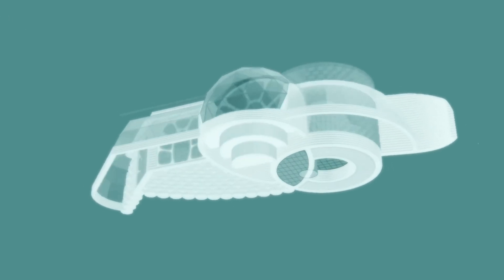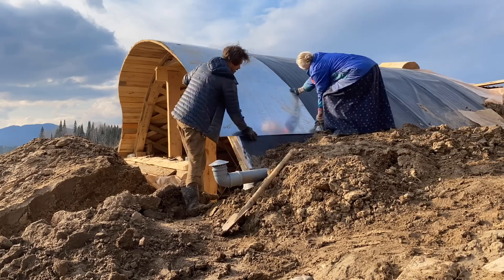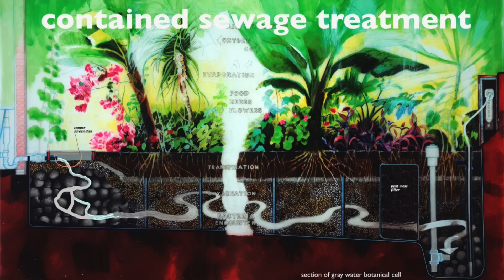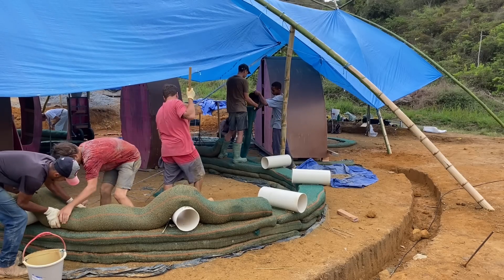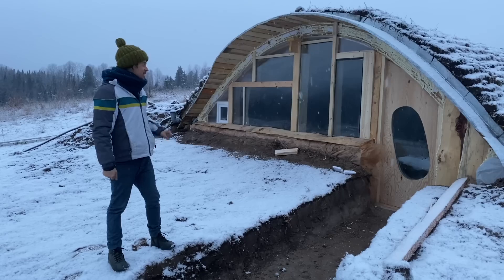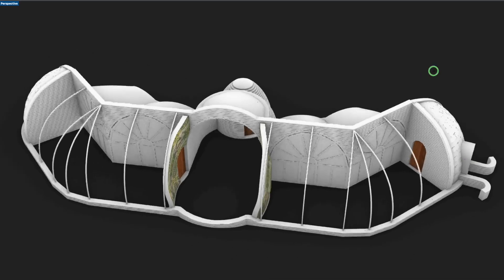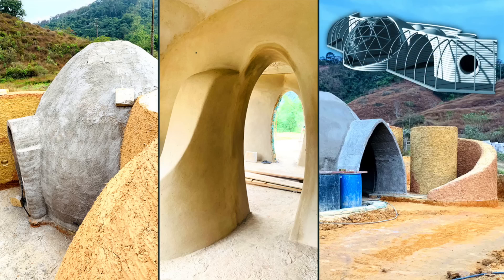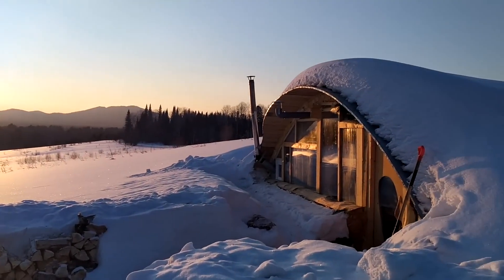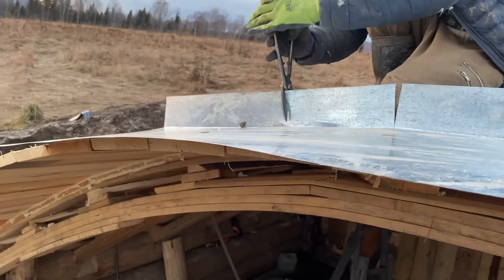In essence, you'll learn how to construct a self-heating and self-cooling Earthship hybrid for a fraction of the price of a conventional home. It will be easier to build with less man hours spent on site. Some of the elements such as the US liquid waste approved greywater black water treatment as well as the cooling tubes are taken as-is from Mike Reynolds at Earthship Biotecture. However, other systems and structural elements necessary for living in unpredictable sub-zero climatic conditions I have infused with robust strengths that only catenary geometries can provide, as well as the well-being that bio-geometry offers inside.